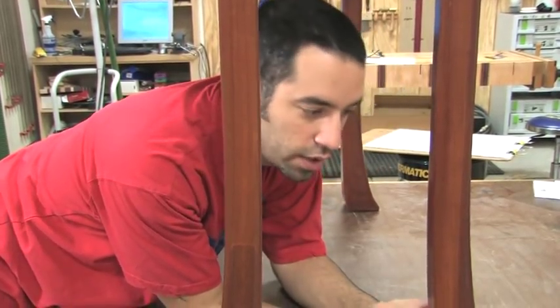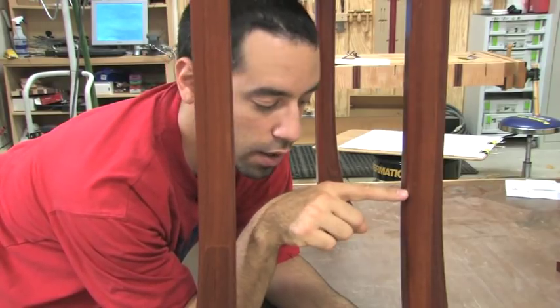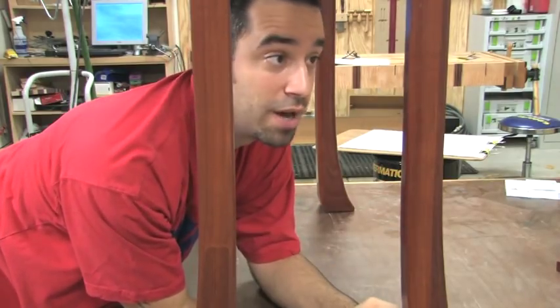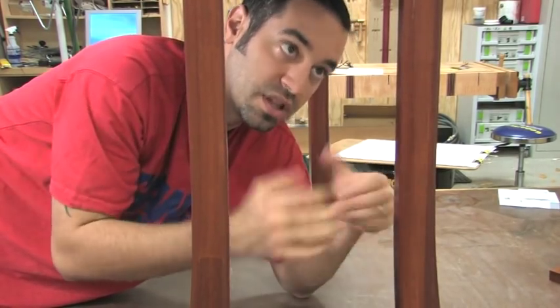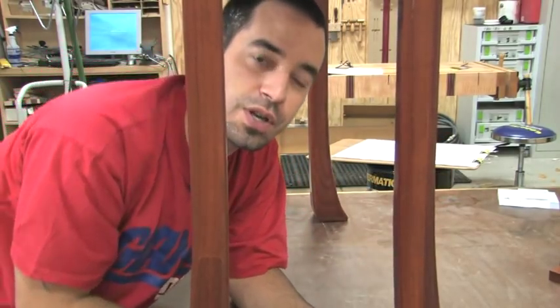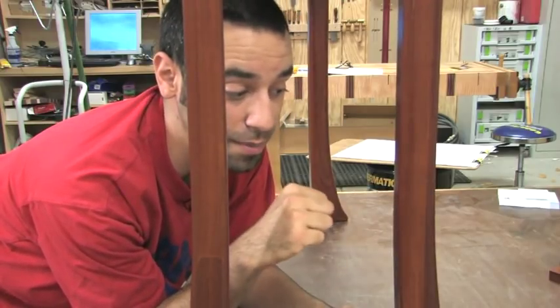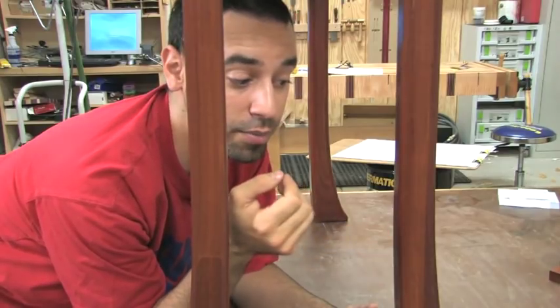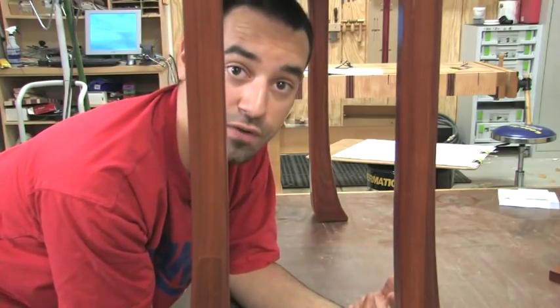This is usually how I spend my time in furniture stores. While we were under here in the shop lighting, which is much better than the lighting inside the house, I noticed a little hairline fracture right here on the front — where it looks like there's a little bit of a split. I don't know how that's going to affect this thing over the course of time but it definitely is something to keep my eye on. Wood has internal stresses and as the seasons change, and we laminated two or three pieces to get this leg as thick as it is — it's hard to say what causes those things, but you have to know they may happen. It's not terrible, but if it starts to spread I may have to take it back in the shop, sand it down a little bit and put in some CA glue or even epoxy to seep deep down and hold that together. Right now it's not significant enough to treat.